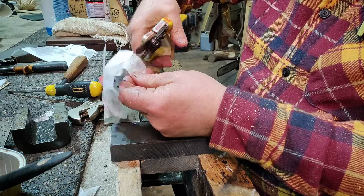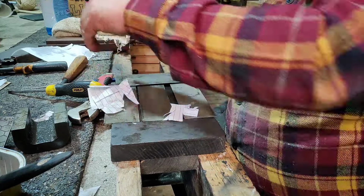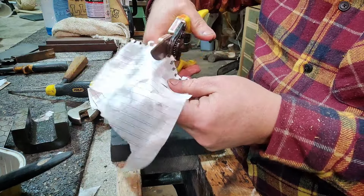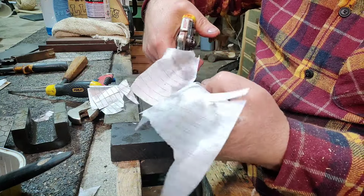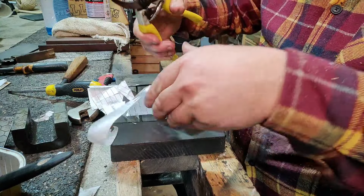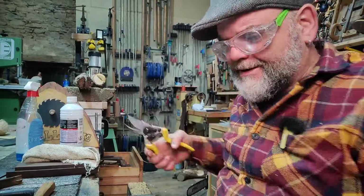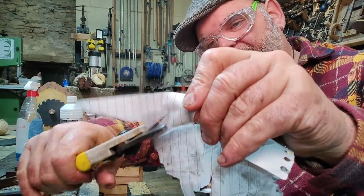Now, if you want to be cutting green wood, like rose stems, pruning for the winter, what have you, they're absolutely perfect. Just proving the point, you see. You don't try and put a bevel on. You utilise the bevel that's already there. But the most important thing is to make sure the backs are flat, because then they'll actually cut. Look at that, that's wet paper there.